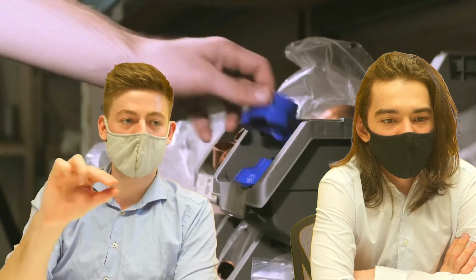I only recommend printing hot like that if you're running a big nozzle and you're printing really fast. If you're doing high quality, like 0.1 millimeter layers, no, go down to 200. But that's not Quinley productivity speeds. That's your artsy, high quality organic shapes. Well, you can do high quality production, you just need a few more printers. I guess that's true. But if you're doing super thin layers, then you don't need the heat.